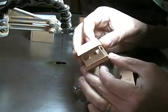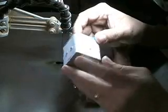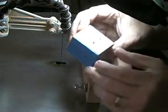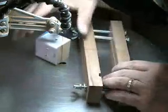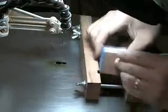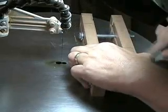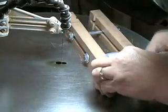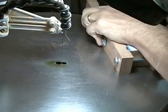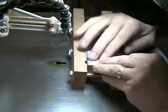What we're going to do is put the raw piece of wood, this one that already has the pattern on it, already been drilled for the inside holes, and already has a little guide cut right there for the size of the chess piece. We're going to put that in the jig right here, and tighten that down. And then we're going to cut the inside holes.